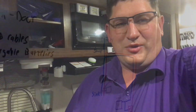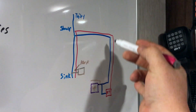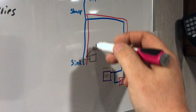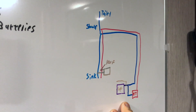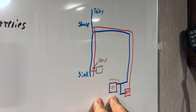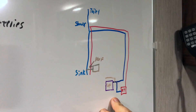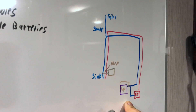When I turn the pump on it pulls water from the hot and pushes it back in through the cold. Because of the way it's joined — cold going back into the supply side of the hot — it just forms a loop, that's all it does. Having the pump in place and not operational causes no problems. The only thing to watch is not leaving the pump turned on with the hot water heater cold, because then the pump just runs constantly, which draws more power than I'd like on a continuous basis.